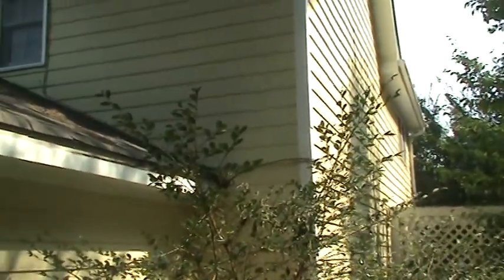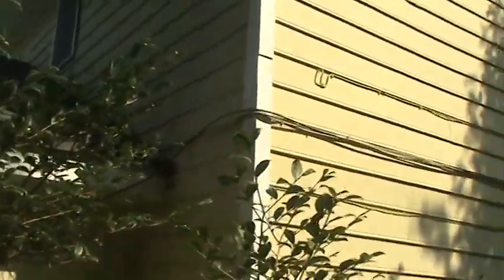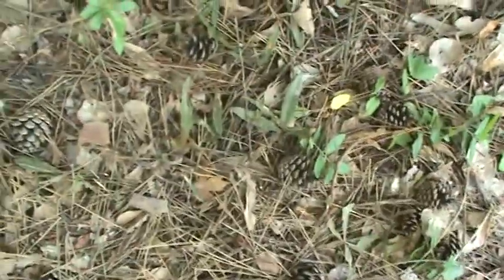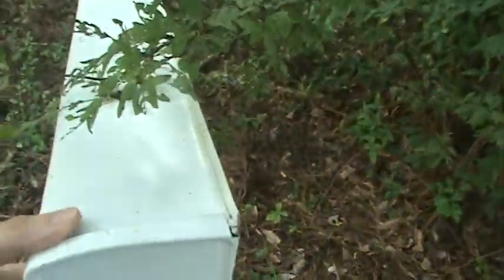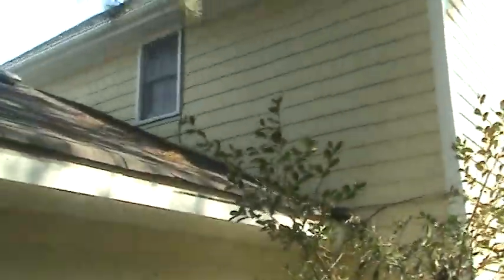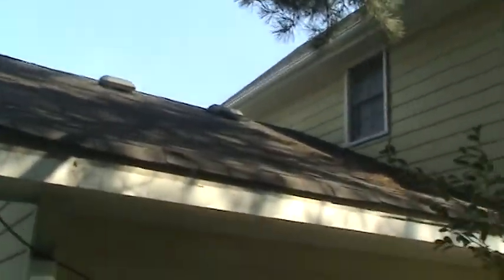On the right side — which is why he called me out here — this is the rear of the garage. They had so much rotted siding in this area that's why the owner called us. The back of the garage is good, but this little four-foot section had no kickout flashing where the old gutter was. Kickout flashing is cut into the siding and sealed on both edges, and it diverts the water back into the gutter. With this closed system there's no way to add kickout flashing. You can see the hidden hanger screws built in through here — they screw those into the fascia board. It's one of the better systems if you're going to put this on your house, but it doesn't quite work as designed. These pine needles, this shaded area — that edge of the gutter is going to get mold and mildew across it. We're going to have to replace about 16 rows of siding from the top of this roof down to the bottom.